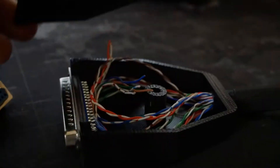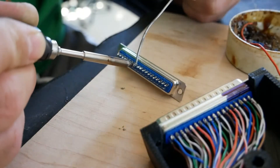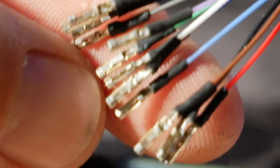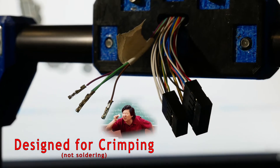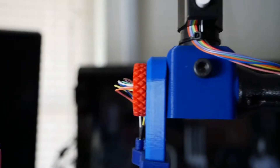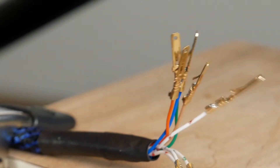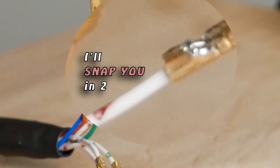I make a lot of my own connectors and wiring harnesses, and I'm pretty OCD about soldering all my connections — I even solder the super tiny DuPont connectors that were intended to be crimped. Soldering creates a super strong bond at the weld joint, but just beyond that lays the purgatory realm of electronic longevity. Right behind that solder joint is a weak, work-hardened area that's prone to fatigue and failure.